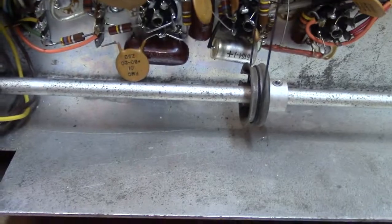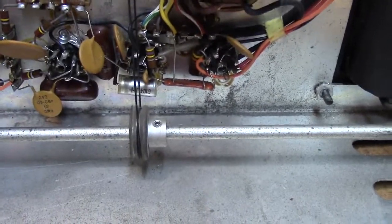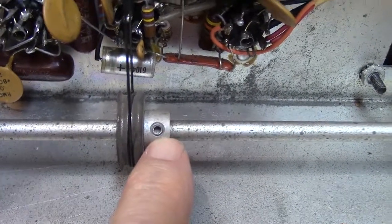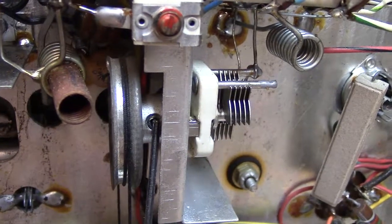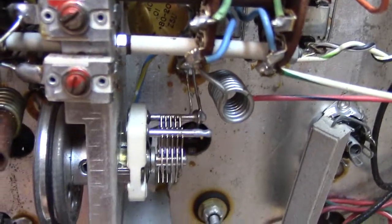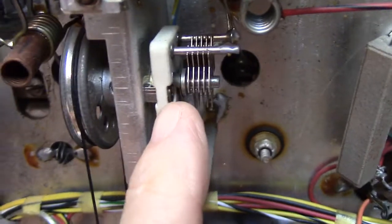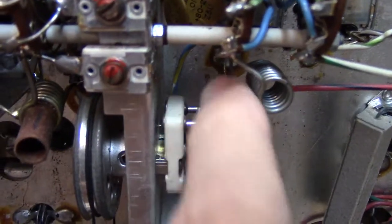What if you wanted to do that with the HQ-170? You can, and I'm going to show you exactly how to do it. First you've got to remove some components. Take your allen wrench and undo this set screw right here, and up here you've got another set screw. You can pull the string off the pulley, then pull the pulley off. The antenna trimmer has two screws in it — take those out and the antenna trimmer will fall loose. You'll have to clip it where the solder connection occurs.